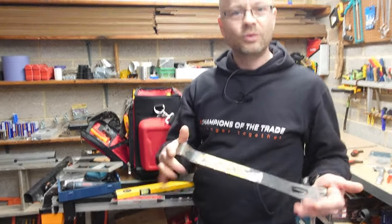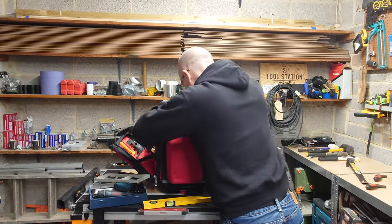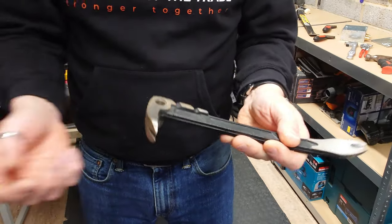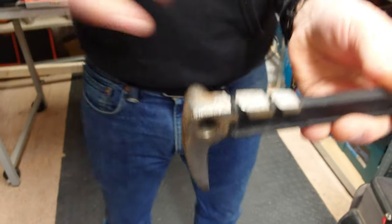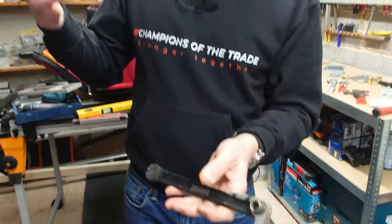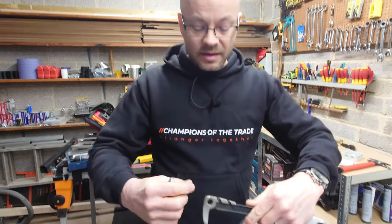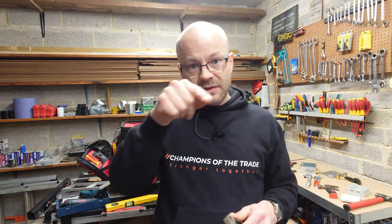You always need a wrecking bar — for floorboards this is my best friend for getting those boards up. I also have another wrecking bar that's more user-friendly with a tighter head, much sharper tips, and different angle options. It's got a nice big hammer-hitting point on the back. The hole at one end is for chipboard flooring — on new builds where it's all glued together, you put it over the top of the nail, smack it down, lift it back out, and it leaves a hole to get underneath without ripping the chipboard to pieces.